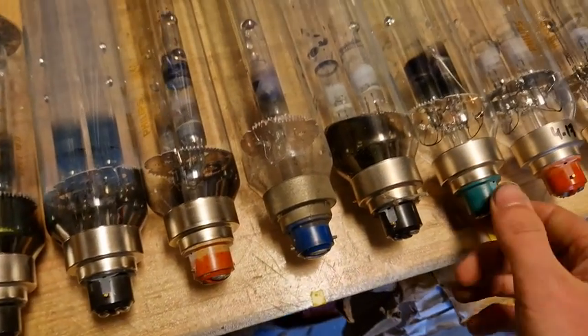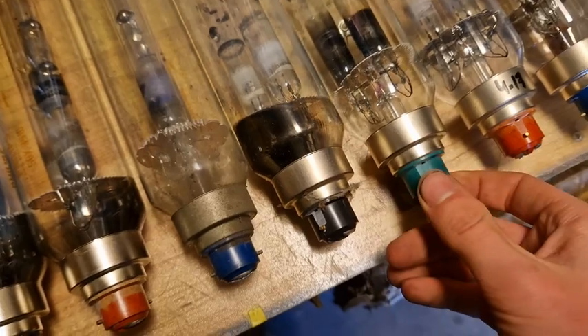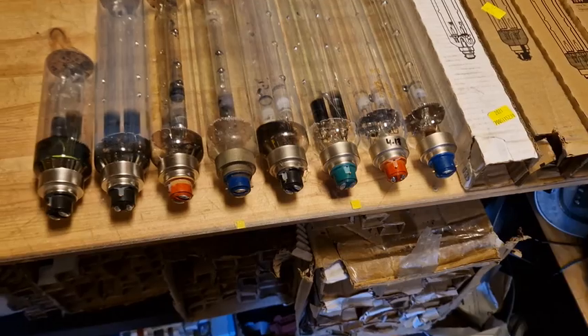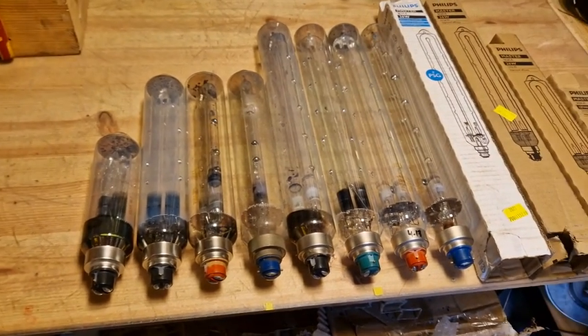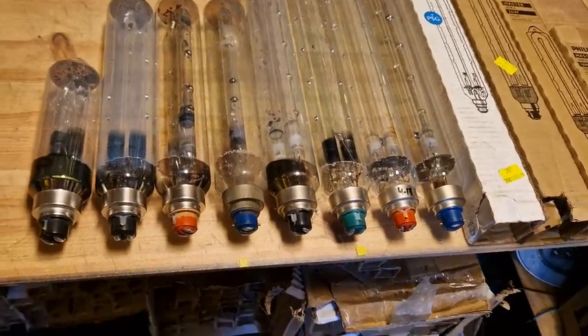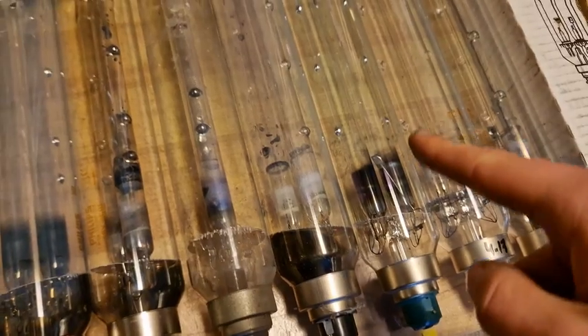The PSG version, being also brand new, does not have a black bottom at all. What's different between low pressure sodium and fluorescent, for example, is that this black spot is actually normal for low pressure sodium — it indicates that the bulb is pretty new or brand new.